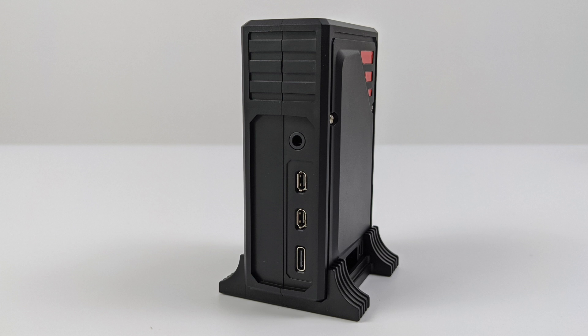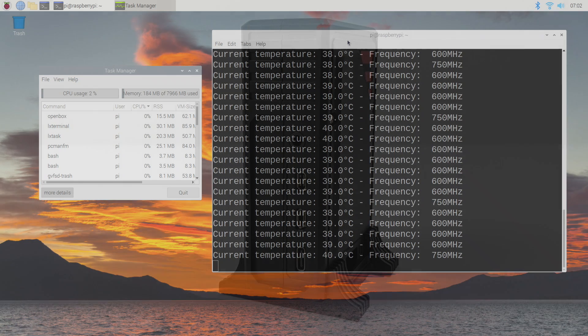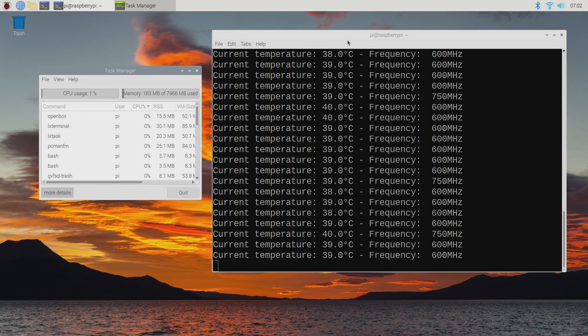Now that I have everything together, the first thing I want to do is run some thermal tests. I'm going to be running Raspberry Pi OS and Stressberry. Here we are running Raspberry Pi OS on this Raspberry Pi 4. I've got the fan set at 3.3 volts. We're at the stock clocks, which is 1.5 gigahertz, and basically this test is going to max out all four cores on the Raspberry Pi 4. It's going to give me a log in the background, and by the end I can create an easy-to-read chart. At 3.3 volts it's super quiet — I'm about a foot and a half away from it and I can't hear it. At 5 volts it's a bit audible, but it definitely cools better. After this, I'm going to run a couple tests with this overclocked.